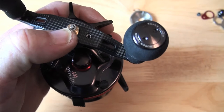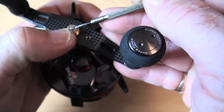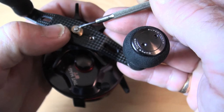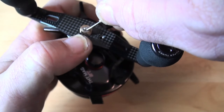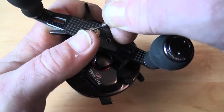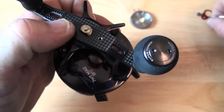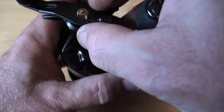Now, there is a tiny little clip in here. If you don't have a pinion support, then you'll have a little E-clip, and underneath it there'll be a tiny little washer, which is a horrible little thing. Put a very small screwdriver in against the centre spindle and give it a little twist, and out it comes. Keep your thumb on it while you're doing it, because otherwise it will warp into another universe and go ping.